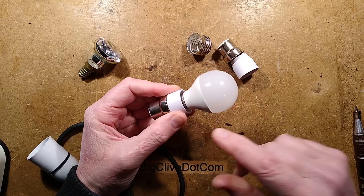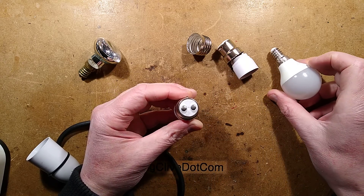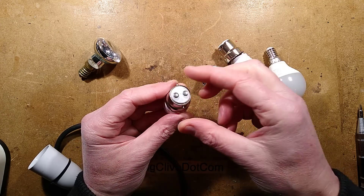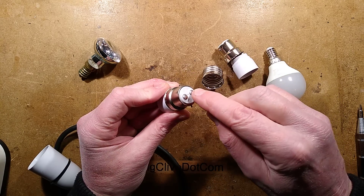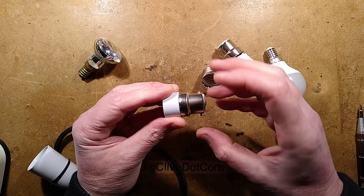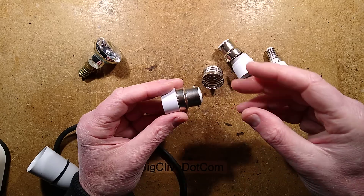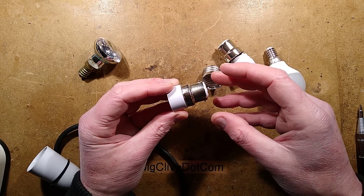You do win points for the fact that you can't touch the metalwork down here, but that's all the points you're getting. Because in the UK, as opposed to the American and other country Edison screw lamp holders, in the UK and India and other countries, we have the bayonet cap lamp holder. This has a metal surround with two pins in the end, and the two pins in the end should not in any way be connected to this metal. This metal should be fairly isolated to the point that when you put it into certain grounded metal fixtures, like chandeliers, then this metalwork here will actually be grounded.